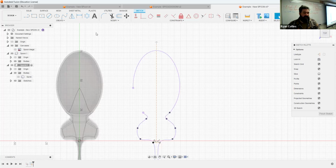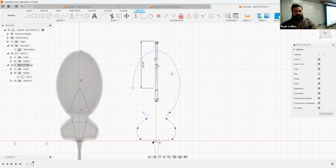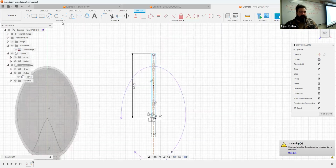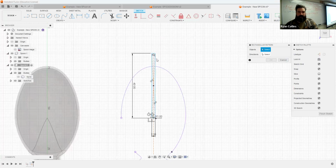All right. From there, I don't know if I'm going to make these into like fork tines. Let's make it easy. I'll use a center point rectangle somewhere on there. Let's make it, I don't know, 2 millimeters wide and wide enough, or long enough, to where it actually goes through. That seems excessive, maybe 40. There we are. Great. And because I want to be lazy about this, let me make some minor adjustments to this. Just adding a fillet to the back end. I don't know, 0.5. Let's make it 1. Neat. Rounded.